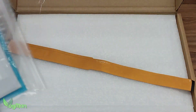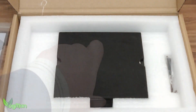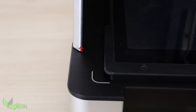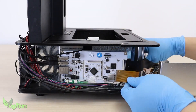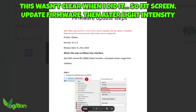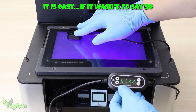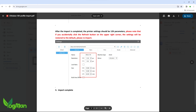Whether they intend to release a full 12K printer or not, I'm not sure just yet. I planned on showing you a fitting guide, but frankly Uniformation did such a good job it rendered that exercise pointless. This was amongst the easiest update fits I've come across. All I will say is: remember to upgrade the firmware — I didn't find this particularly clear, so please make careful note: fit the screen, update the firmware, and then carry on with the light intensity. Also do change your settings in your slicer. These aren't universally available right now so you'll need to adjust them, but I've no doubt the slicer companies will soon catch up.